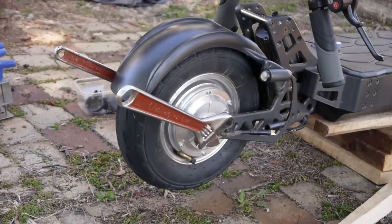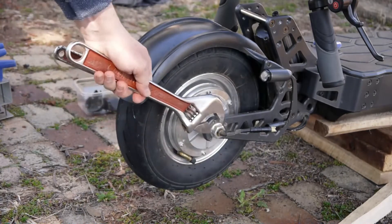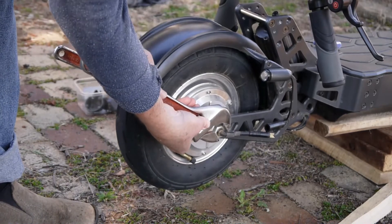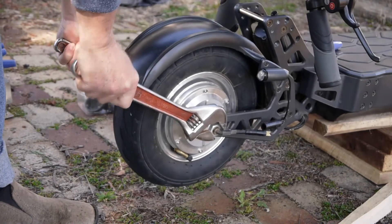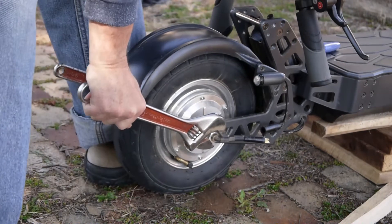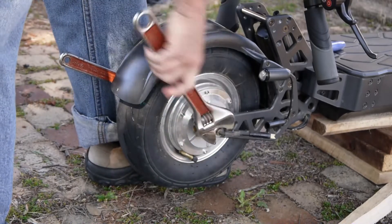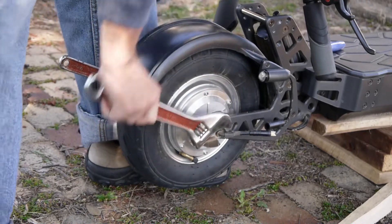I just thought I'd show you that I'm using pretty big spanners, even though they're shifters. You can put them on there. When you're using your shifter, you always want to wobble it and tighten it at the same time. So take it off, re-establish it, make sure it's snuggled in each time.